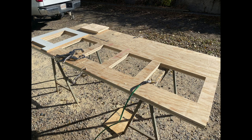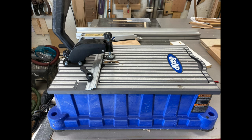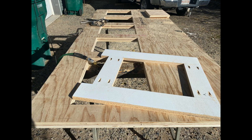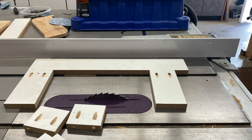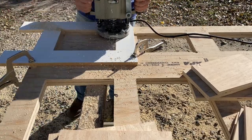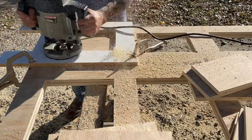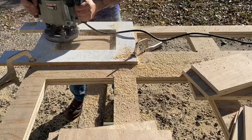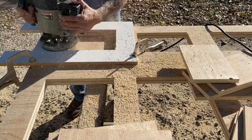Recently I had a project where I needed to cut a few different sized holes. I wanted them super clean, so I used a router — here's an easy way to do it. I made a jig with some scrap melamine, started with a bigger size using pocket holes to assemble the components. Working from larger to smaller, I can cut the jig down and keep on cutting more holes. It's super fast and effective, and I'm doing two layers at once just to save time and improve accuracy.